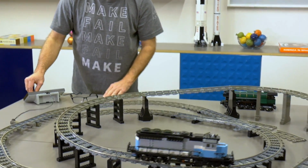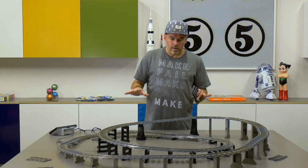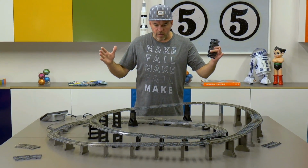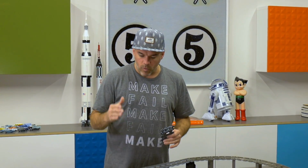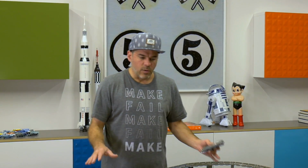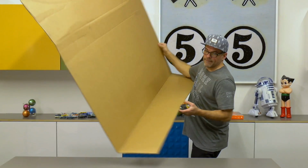And it looks like we're in business. What we've got to do next is transfer this onto a piece of cardboard, and we'll compare the diameter of our Christmas tree to this layout, and we'll transfer each one of these vertical elevations down to a known position, and then we'll build that back up in cardboard or in Dow foam.